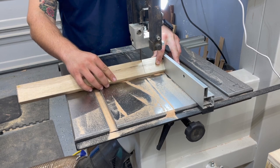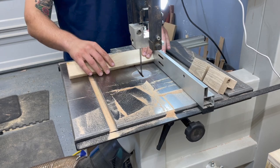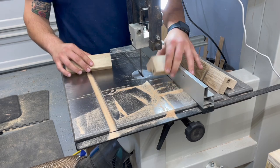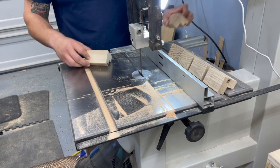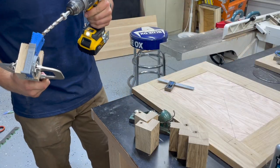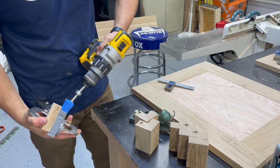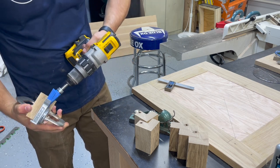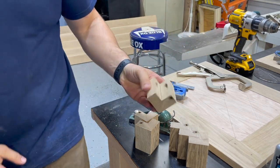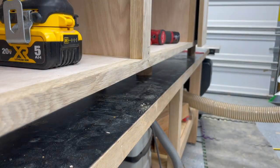Since the bandsaw was already fired up, I decided this would be a good time to cut out all my legs — three-inch-long legs — and the bandsaw makes quick work of this and minimizes all my waste. To attach the legs to the cabinet itself, I'm going with pocket holes — that's going to be plenty strong. I'm not even going to glue these on so that if we ever decide later on that we want to change the base, we can.